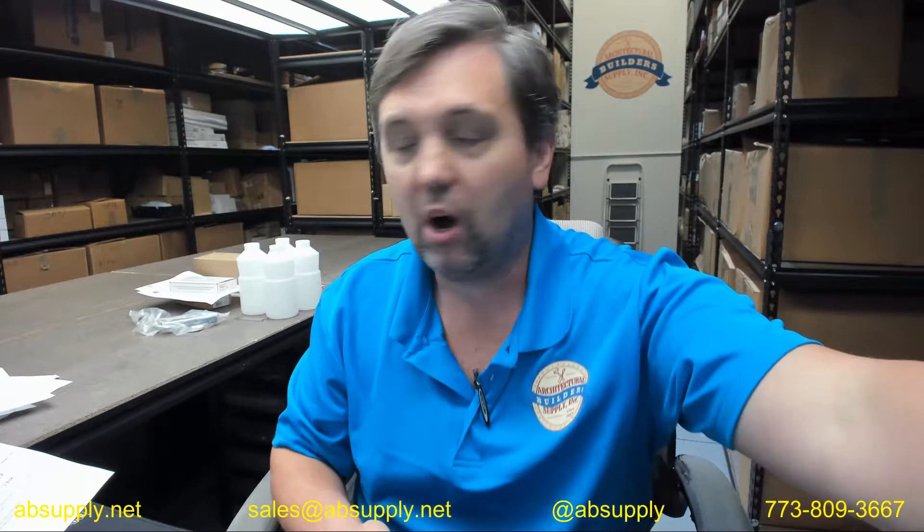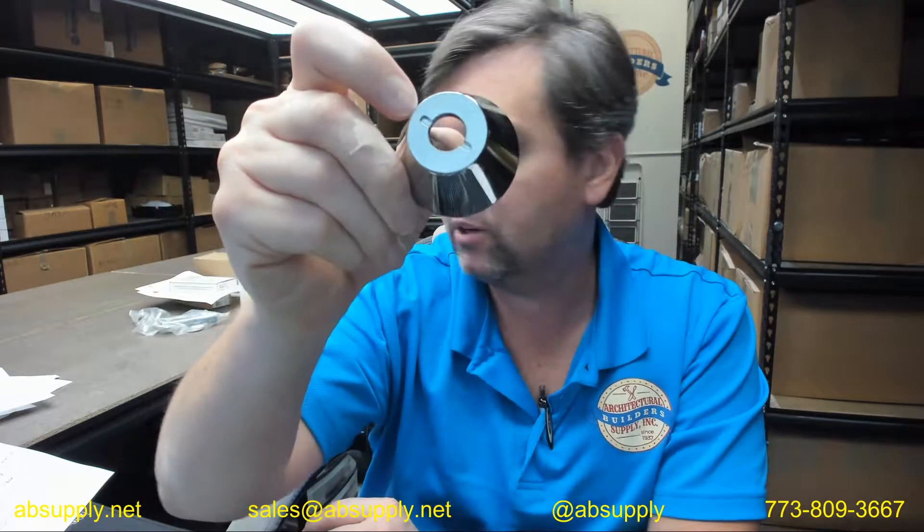This collar will work for all of them. Why you would replace it — maybe vandalism, or maybe you've unintentionally lost it or thrown it away. Two inch outside diameter, overall height of the unit is one inch. This is chrome plated and I believe it to be brass, but I don't know that it's brass. It's not magnetic, but it's awfully inexpensive for a big, heavy piece of brass. This weighs 0.23 pound, so I'm very suspicious that this is made of brass when it's a quarter pound of brass.